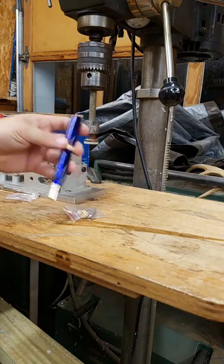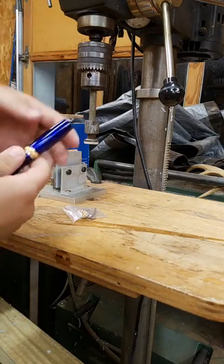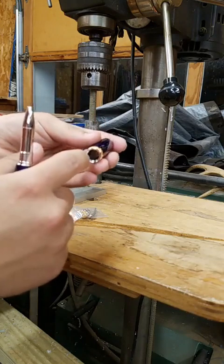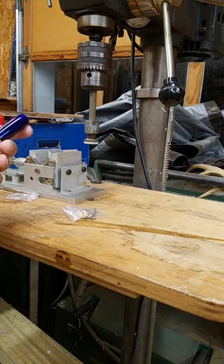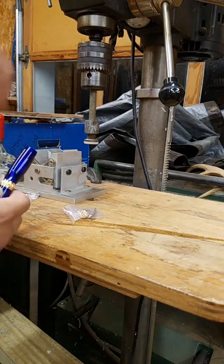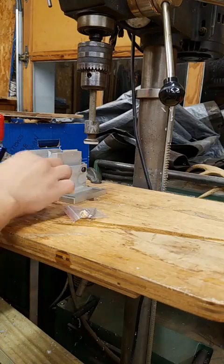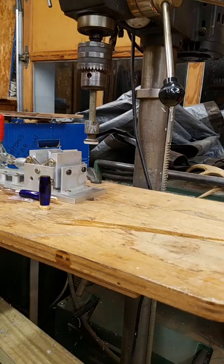If you're too aggressive with it, you run a strong chance of blowing up your blank or cracking something that's involved. There's a plastic insert inside of a lot of these kits where the cap screws on. Most of these are soft material, not really rigid, strong material. So be careful not to press too hard or you'll crack that inner section and you'll have a terrible time getting that sorted out. So just be cautious with that. You can be pretty gentle pressing these kits together.